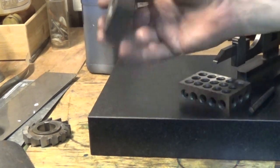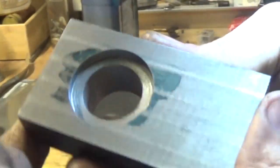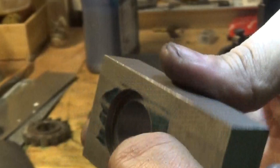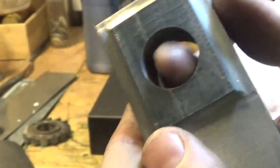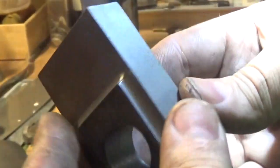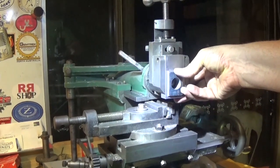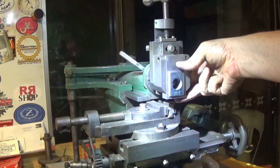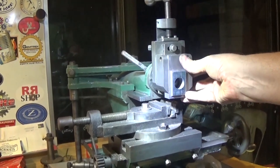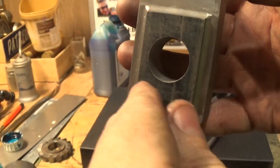Now, a friend just pointed out that I didn't sort of film this. I've just set this up and I've used my new solid rock boring bar. Another video about that soon. But I've bored this out here with a recess. It's plenty big enough, and that's a 7/8 hole through there, so that's what size the lantern's going to be. I'm pretty pleased about that. It seems to all look pretty good. I'll give you some idea how it's going to look over here. I'm really pleased how that's coming together. We've still got a round over the top, and put this hole through here for the roll pin, for the tapered pin. Next job I think is to put some serrations on here.